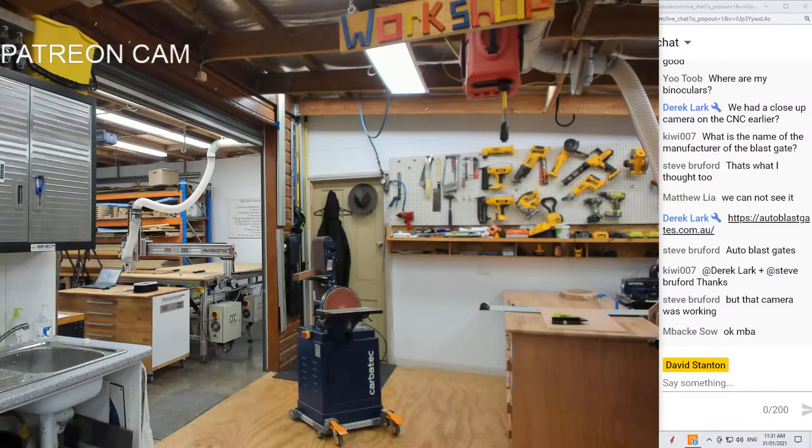That's so depressing. All right, it's in. I'm going to do my check. Touch the Z off, job secured, no obstructions. Turn on the extractor, turn on the VFD. The correct cut is in, the code is in. It's already been homed. We are in metric, and as soon as I push cycle start, it'll happen. Now I'm going to go back over there in front of that to just keep my eye open. Let's see how we go.